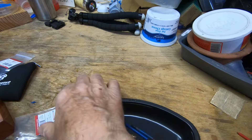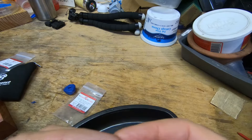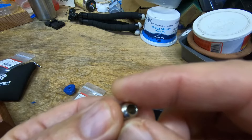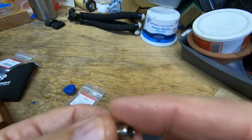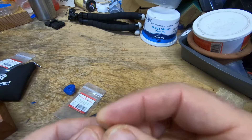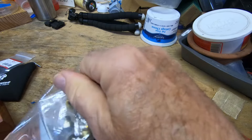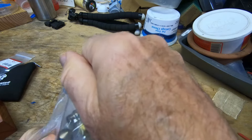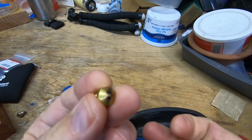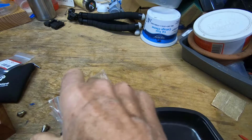Normally in the past I've just been buying new nozzles. They're not super expensive. These are the Micro Swiss ones. I like those because they have really good tolerances — they're nickel plated. I'm not printing anything fancy like carbon fiber or wood or anything with extra fibers that would really affect it, but I just found they work better than brass nozzles. The nozzle diameter is just more accurate with this one because it costs more and it's machined better.